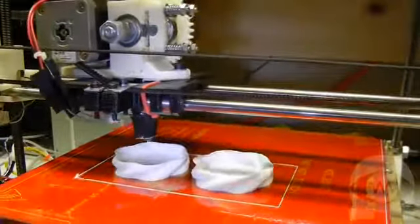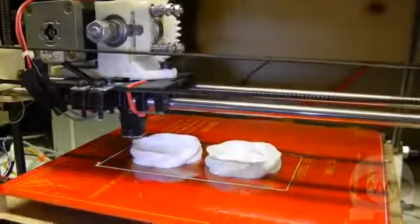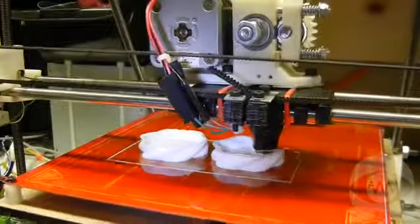This is a Maker Gear hot end. It has a ceramic-coated nichrome wire heat core, the same type of wire that toasters use for heat. The heat core is screwed onto a brass barrel with a nozzle on the end that has a small hole in the tip.